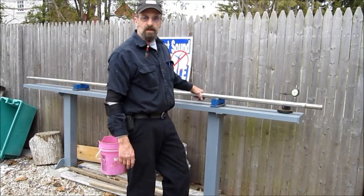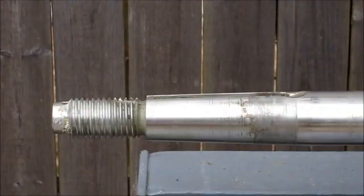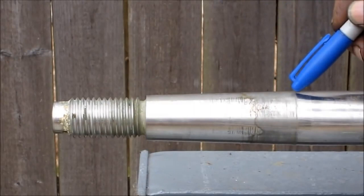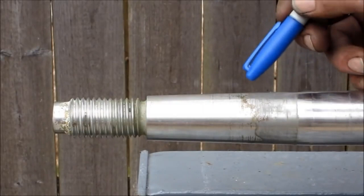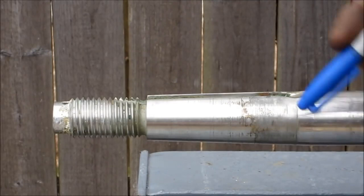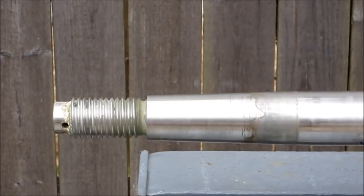This shaft just came in this morning and we checked it for runout. I'll be doing a dye check on the keyways, making sure there's no breaks. One thing that was interesting is the fit on the propeller. I'm doing a shaft check — hope to check it for cracks and everything else — but the first thing I'm checking for is contact, wear, and obvious things the average person won't look at. You can see right here the major diameter of the taper is making good contact. But that line marks the end of contact — the propeller is not making contact anywhere past there. This is why it's important to do lap fits and bring those two diameters to full contact. You need at least 70-80% contact on your taper.